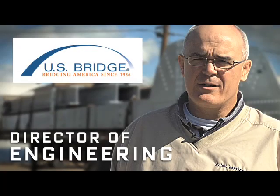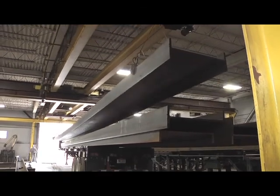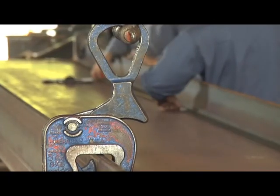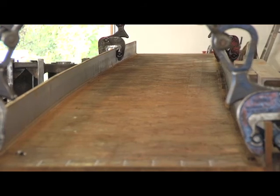We took the automated design out of eSpan 140 and modeled it in our CAD workstations. We export the results of that into our computer-controlled machines, and then the line processing happens. The beams come in to approximate length within a few inches, then are cut to exact length so that the bearing points are exact to match a survey in the field, and the distance beyond the bearing points are exact to create an expansion joint at either end of the bridge. The intent of cambering the steel is to counteract the deflections from the dead loads imposed on the bridge, so it's simply a way to get your beam to end up along the grade or slope that you intended.